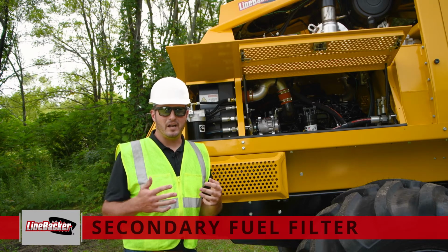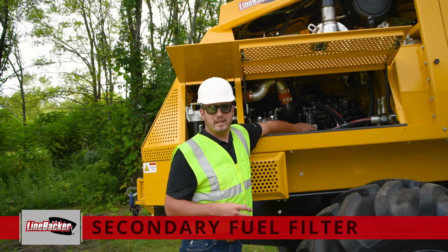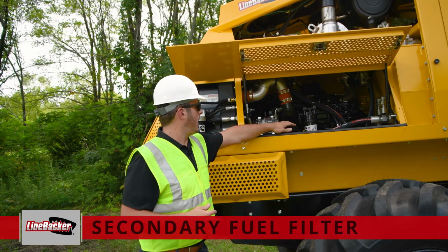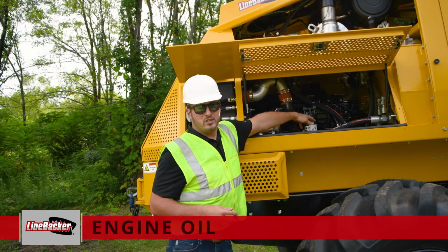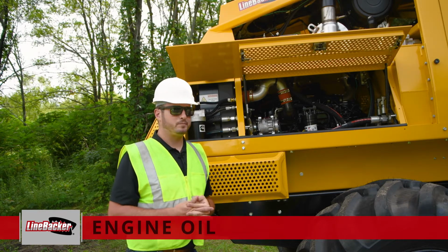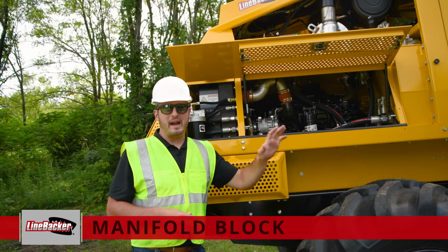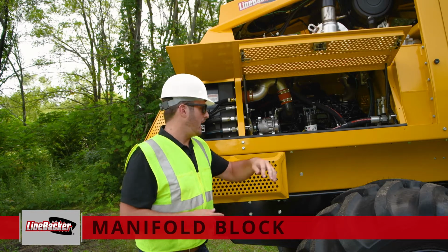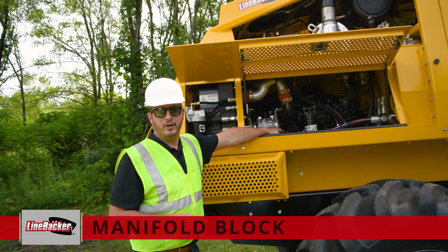So if you are ever experiencing dirty fuel issues and you just can't seem to get that machine to run correctly, be sure that you change your secondary fuel filter as well, because there's a chance, if you have a dirty transfer tank or you have dirty fuel going into the fuel tank on the machine, you're going to have some dirty secondary filters there. Located just behind that is your engine oil dipstick and engine oil fill. So we're checking that daily, pretty self-explanatory there. And located just below that is the module that actually actuates that fan moving back and forth. So if you're ever asked by any service professionals or you're doing a bit of self-diagnosis, the manifold block that controls that engine fan is located just below that filter and your engine dipstick.